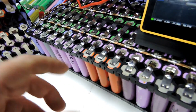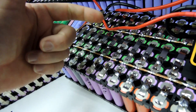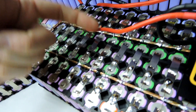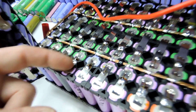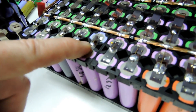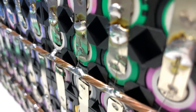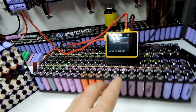These ones are yet to be done because I don't have any busbar materials yet. A common question I've had through DIY Powerwalls on Facebook is why I'm not fusing every cell anymore. Well, I've got two cells, three cells, and then three cells all joined together by nickel strip and spot welded on. Then on the negative side I've just got copper soldered to join it up, and on the positive side we have the five amp fuse wire.